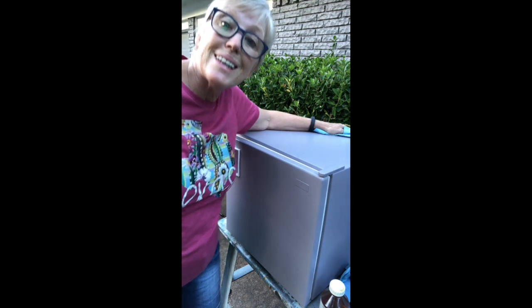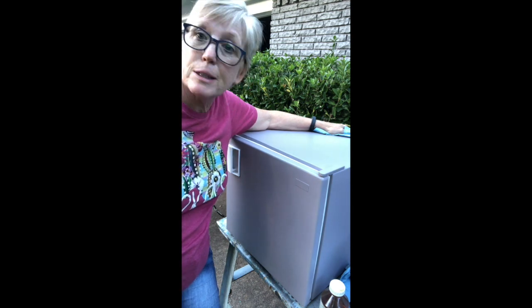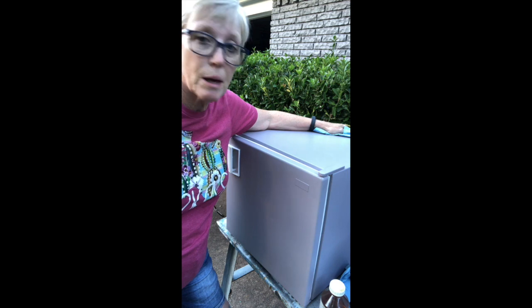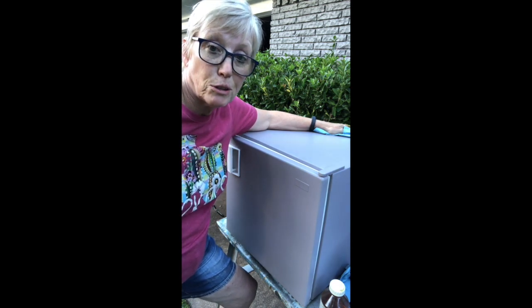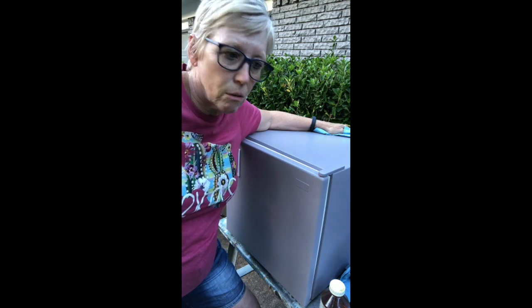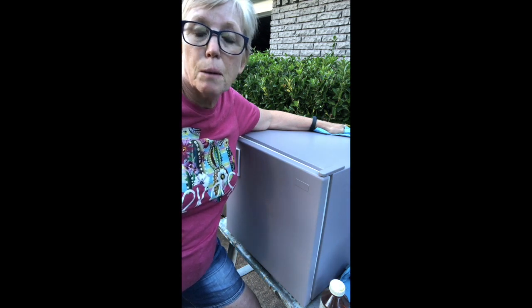So that's it. So step one, clean well. Step two, apply a coat of Ultra Grip. Step three is paint. And you can be done. Or optional step four, I just polished with hemp oil. Another optional step four would be to put an IOD transfer on it. That could be super cute. I don't recommend hemp oil for a sealer over a transfer, but if you did a transfer, then you could come back and wax or poly it to seal the transfer. Or you could do some stamps, or you could paint with stripes, or you could stencil. I mean, the options are endless.